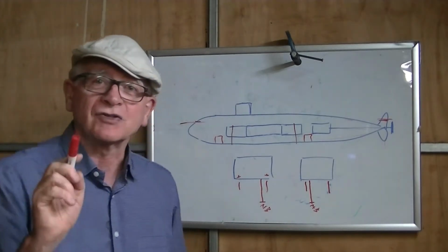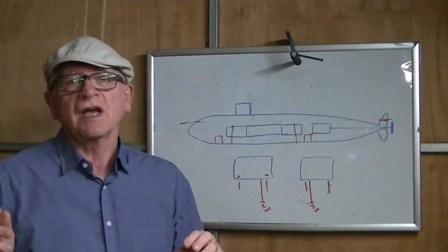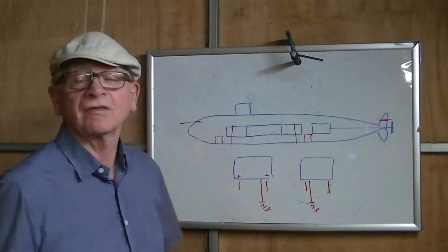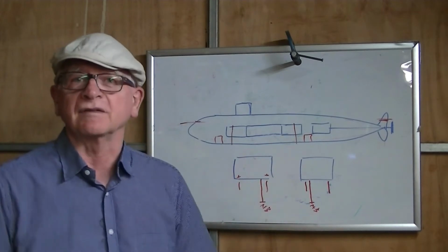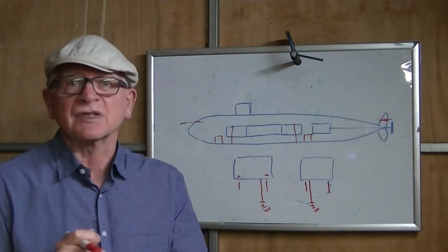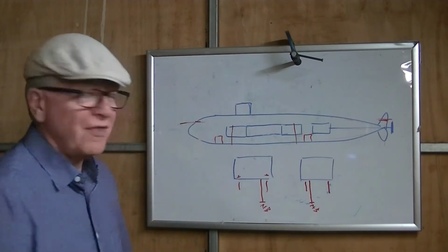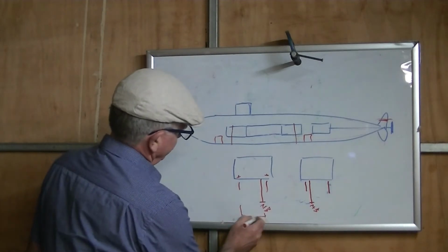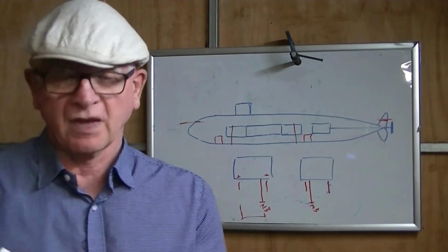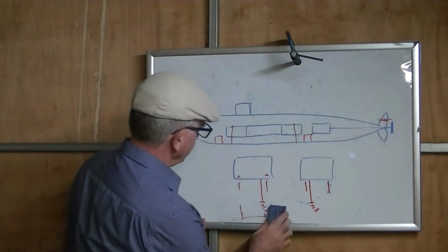The trick about that control, however, is that it's not controlled by anything. Which means, if I put the boat on the bench and disconnect one of the pistons and run this piston using the trim, I can take it right out, disconnect it, and then feed it back in. That's how I get the piston in and out. That's pretty smart. And you tend only to use that particular button just for the fine adjustment. So that's a nice thing to do. The third button is the diving and the surfacing routine, and that runs between here and here, from fully surfaced to snapshot or to neutral buoyancy. There's a bit more to that one as well, which we'll explain as we go along, that we also have to control. But that's what we want to do.